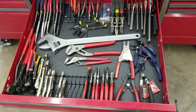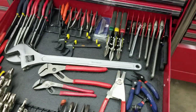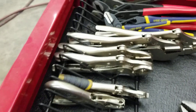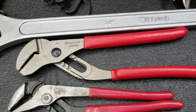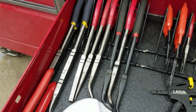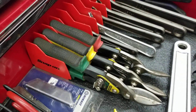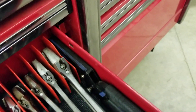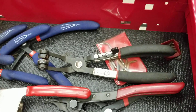The pliers drawer is usually the most disorganized drawer in a toolbox. These little racks — you can buy them online or from Snap-on — help keep pliers from being a tangled up mess. Starting out, critical needs: you'll need a side cut, a normal plier, a needle nose, some locking or vise-grip pliers, and a groove-joint or channel-lock type plier. Long-reach needle nose pliers are handy because they get into places your big mitts won't go. Hose-cutoff or hose-pinch-off pliers for squeeze-type hose clamps — get a set of those, they'll help you out in the industry.